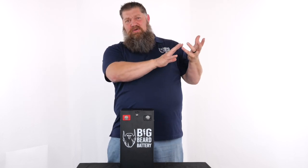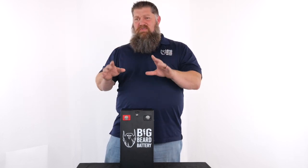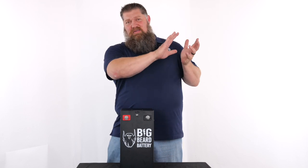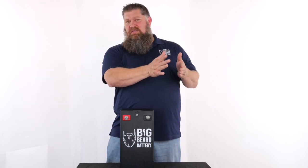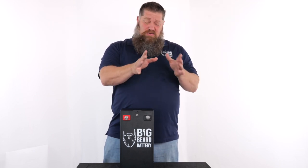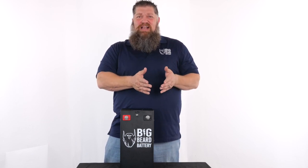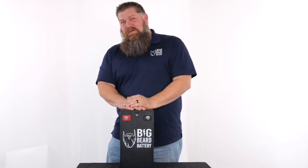It takes power to change power. On 12-volt inverters, they may run 90% efficient — meaning 90% of what it pulls out it can convert, and the other 10% is used in the conversion process. At the 24-volt variety, the efficiency is a little bit higher, maybe 93–94%. That means I can get more out of the battery because I'm at 24 volts already, and I can run things a little bit longer.